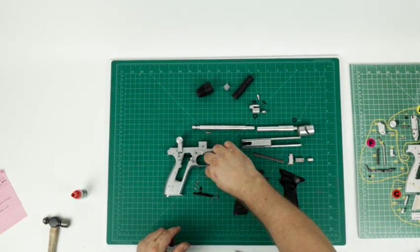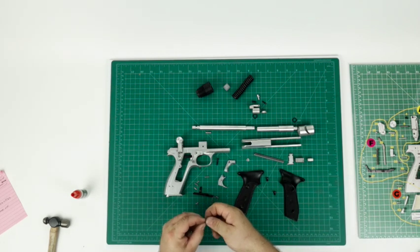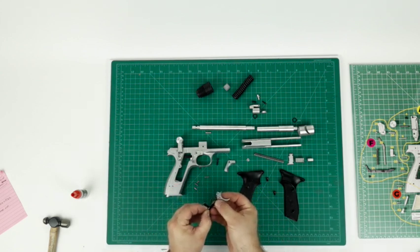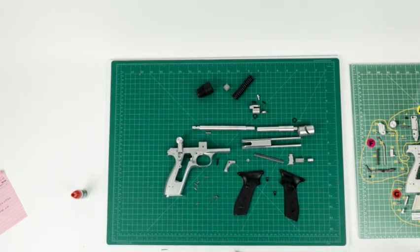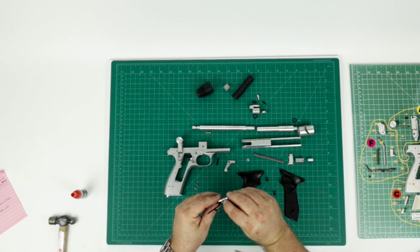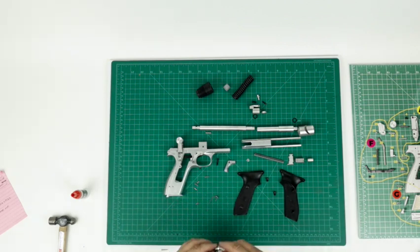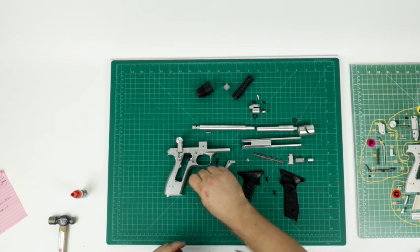Next, we've got parts 25 and 23. Part 25 is the short dowel — an M2x16. We want to get the trigger linkage attached to the trigger here into this hole. Line it up and push that through, then tap it in flush. Notice on the back you've got a hole that breaks into the slot — that's for the trigger spring. I did alter something from the real Margolin: there's a different type of trigger spring that actually went in this slot; it's really difficult to put in. I designed it this way so it'd be a lot easier.